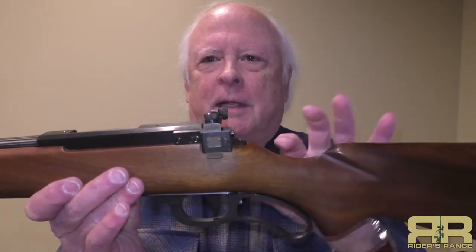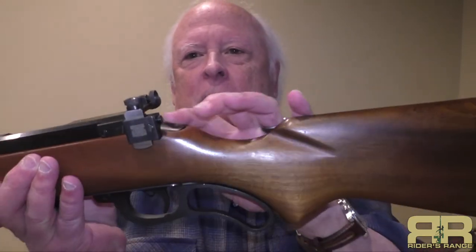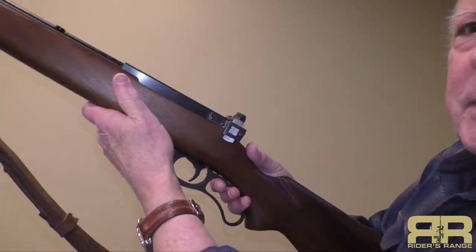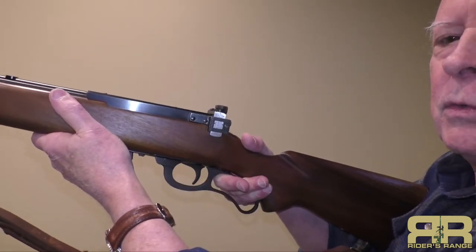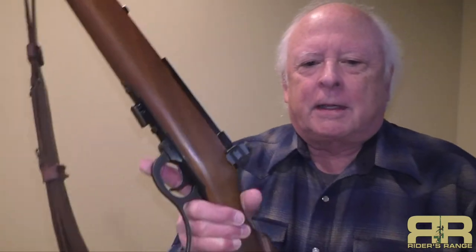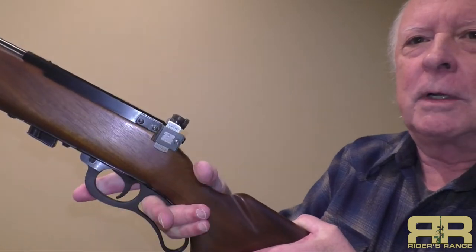The Levermatic is an interesting concept. First of all, there's the one-piece stock — not like most lever guns that have a two-piece stock because of a steel receiver in the middle. This one's all one piece, and it doesn't have an exposed hammer like most lever guns do. The 'Levermatic' part comes from the short stroke of the action — that's it to fully stroke the action. It has some type of cam and roller, what they call an accelerator, to make that action short. It only runs about 25 degrees, and the whole concept is keeping your hand on the stock while you work the action.